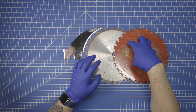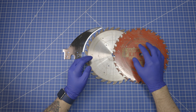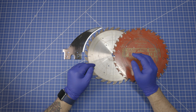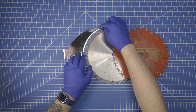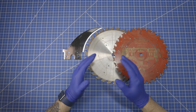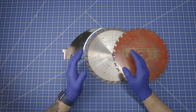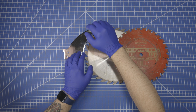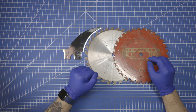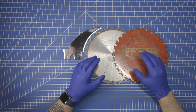That's only because the difference between a 250mm blade and a 10-inch blade is about 0.2 inches — actually less than 0.2 inches. Because a 250mm blade is smaller than 10 inches; you would need a 254mm blade for true 10 inches. So what we're going to do is just shave down the top of this riving knife. That won't affect the functionality with a 10-inch blade — the difference is minor and you're not affecting the safety of using a riving knife. Let's go into the shop and I'll show you what we're going to do.